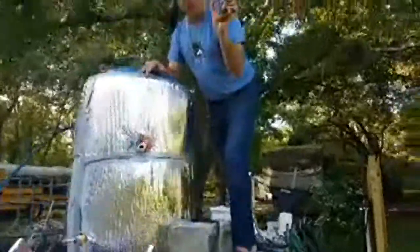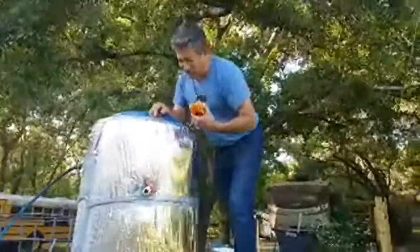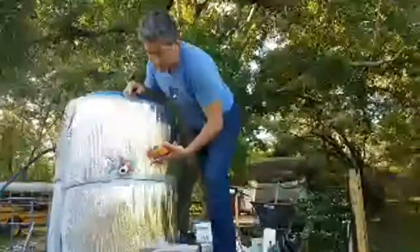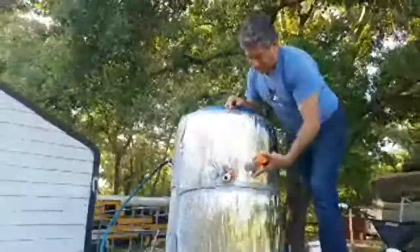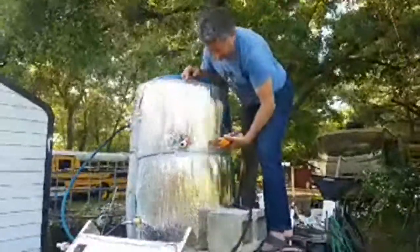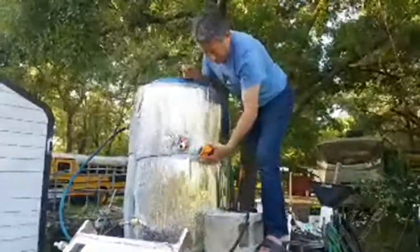It's 87 degrees Fahrenheit outside right now, ambient, but we've let this sit in the sun for 2 days now, and the question is, does 2 days on a single panel give you twice the amount of hot water? Does it fill the whole barrel with 110 Fahrenheit water, or thereabouts, 107 to 110? Or does it just fill the top because it's going in at this mid-level? Does it just heat this up more? So we're going to see if there's a thermocline when we get past this middle section here.